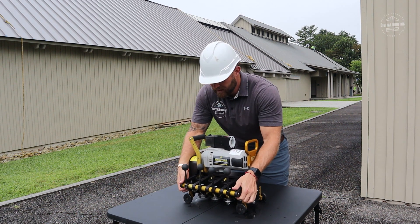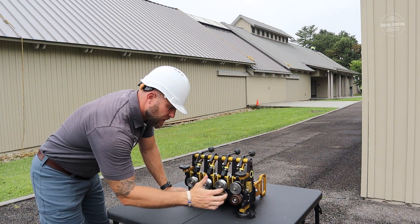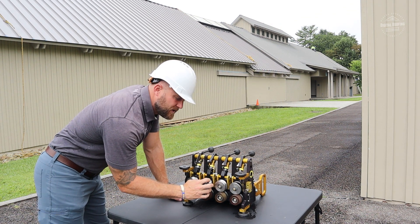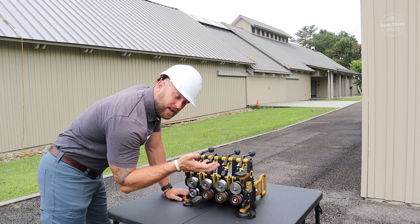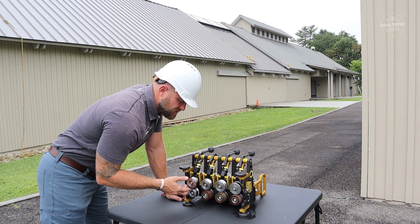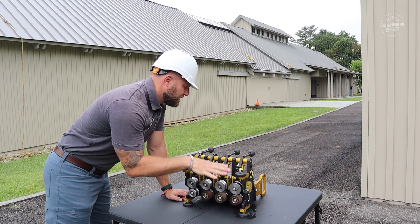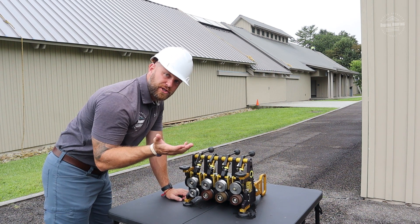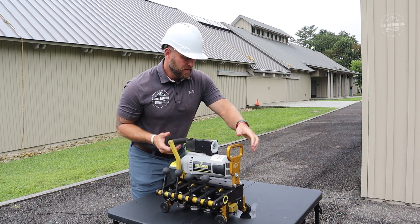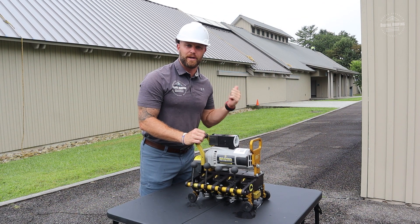At the very end of the video I'll go around the entire machine so you can see all the different components. As you flip it over, you can see the tracks where your standing seam goes through. Make sure these are cleaned out periodically because gunk can get stuck in there as you're installing panels. If you have any problems with that part, it may be a simple calibration adjustment you need to put into your seamer. Without further ado, let's hop on the roof and see this thing work in person.